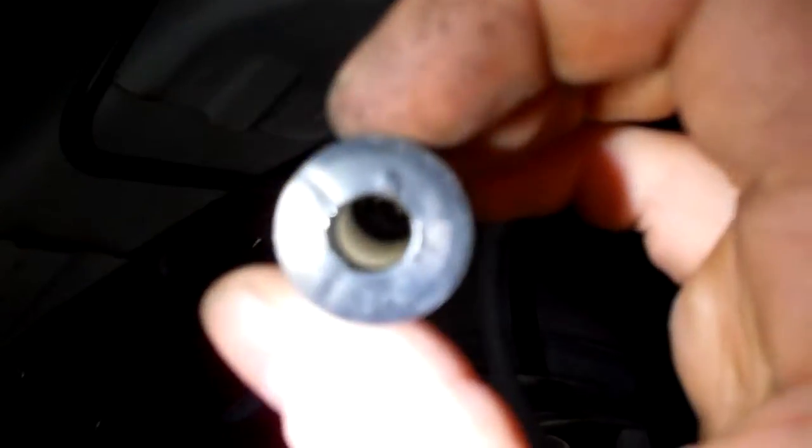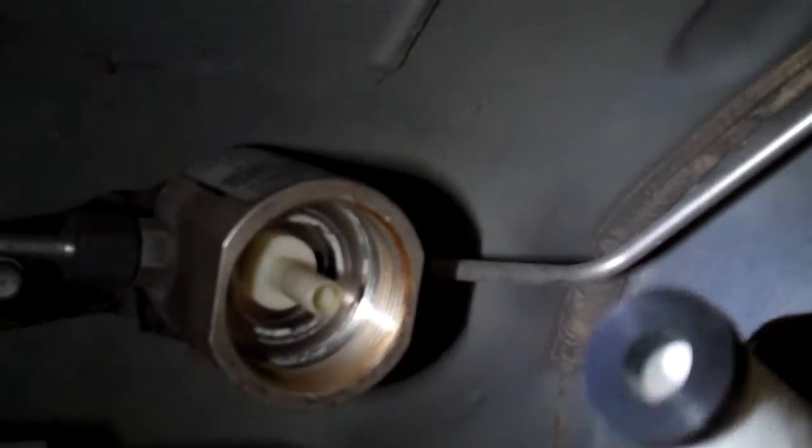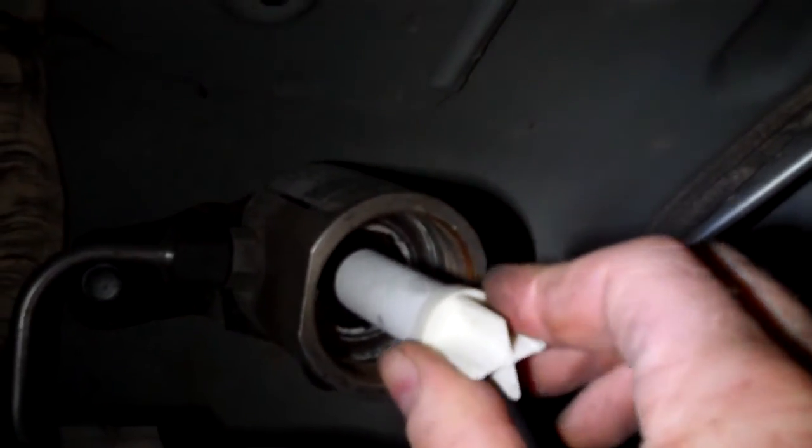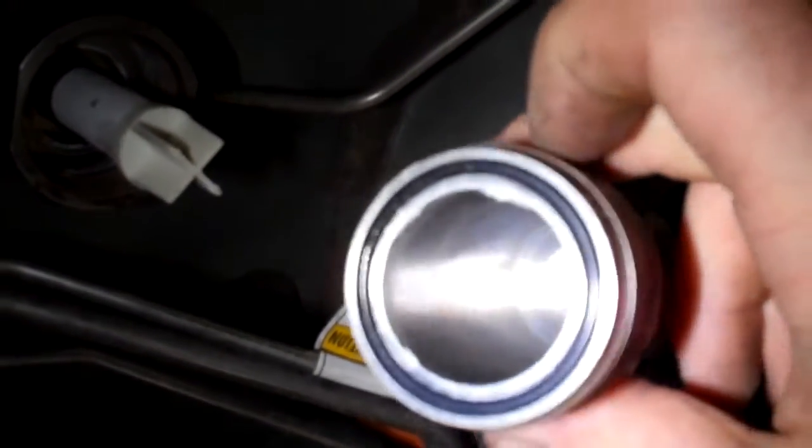So when you look at the filter from the inside, you can see what kind of crud is in it. When you look from the outside, they'll always look pretty clean and nice. Take your new filter. A lot of times you'd want to oil it to help it go on smoothly, but with these you don't want to do that because that equals contamination. You don't want any oil or water — those are the two enemies here. Inspect your O-ring, make sure it's intact and in good shape. Go ahead and put this back on. Tighten this up first so it's good and snug, and then after you've got it tight, go back and tighten the other one. Don't forget or you're going to leak. If you're going to do this yourself, make sure you do it right.